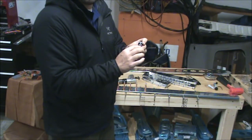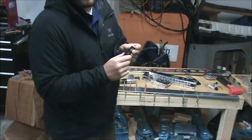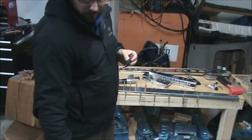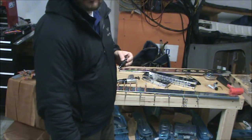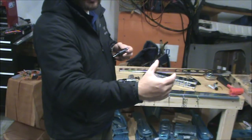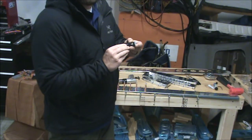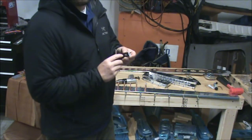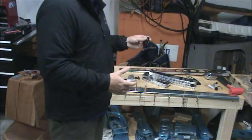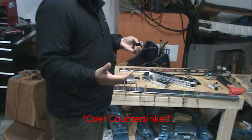Personally, since I don't trust that this tool is a thousandths of an inch yet, I'm going to do some testing with it. Maybe do three clicks and then put the skin on there and see if the dimple sits in there, and slowly work towards that seven clicks and make sure the dimpled skin sits in there flush. It's better to be a little bit more conservative than to remove too much material, and then you're stuck with something that's over-countersunk and needs to be replaced.